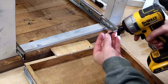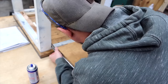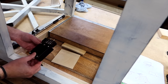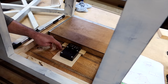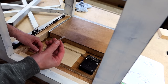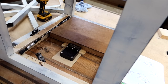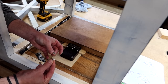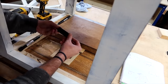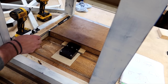The half inch overhang will sit perfectly on the back of the drawer. Just center it up, pre-drill, and use some small quarter inch screws. Now let's install the lock — put the drawer back in and cut a five inch by five inch piece of quarter inch plywood to use as a lock plate. The lock itself will sit down onto this. With the drawer closed and the lock pin in the lock, trace everything out so we know exactly where to install the lock plate. Once the lock plate is in, fasten down the lock with the hardware provided. Pre-drill where the lock pin lines up and install it with the provided screws. Do not forget to check out our Patreon community — it's growing like crazy, over 100 members now. With the lock installed we'll give it a little test, and if everything looks good we'll move on to installing our struts.